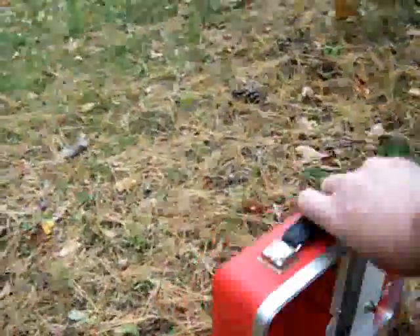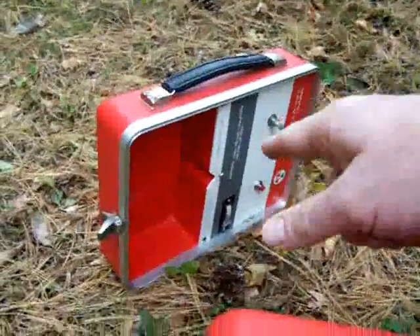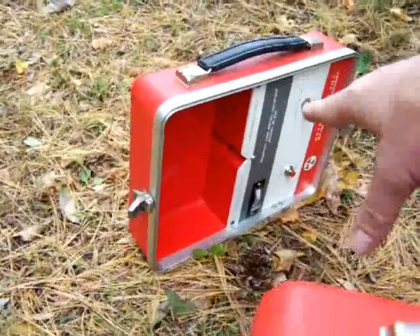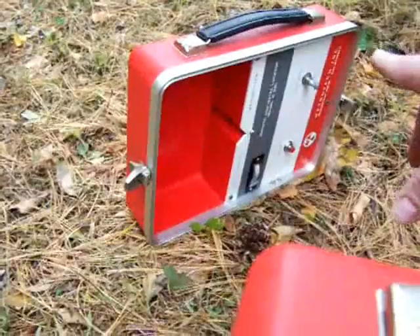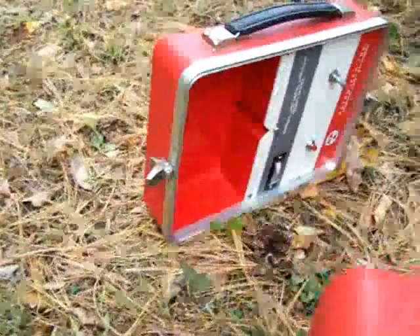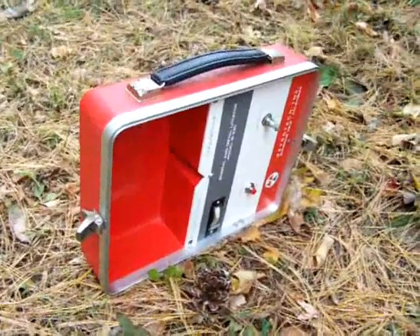For instance, I know there's a cable here because I can see the source of it right here. I can see the conduit going underground and I know it runs off this way. So I can put my transmitter approximately where the cable is and transmit underground. This runs about a hundred kilohertz sine wave — a little higher than the newer 480s which run around eighty-four kilohertz.